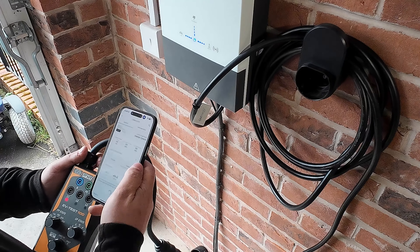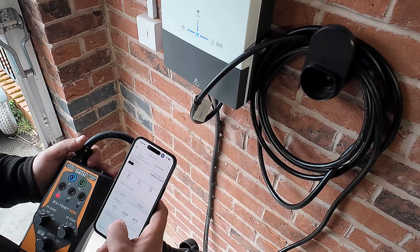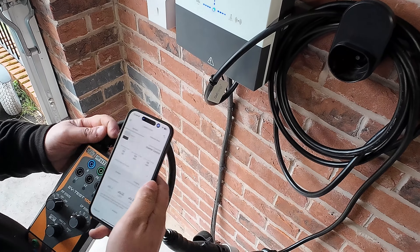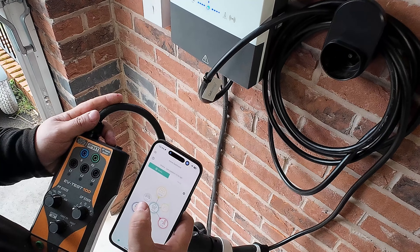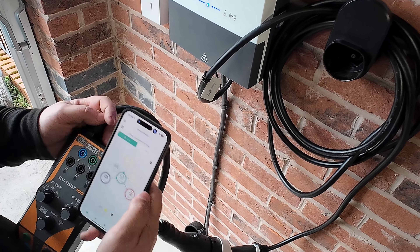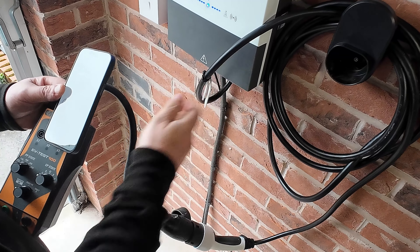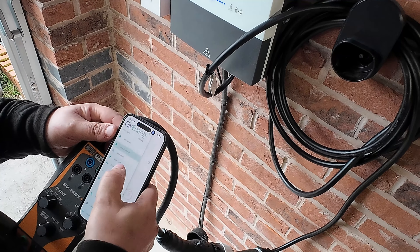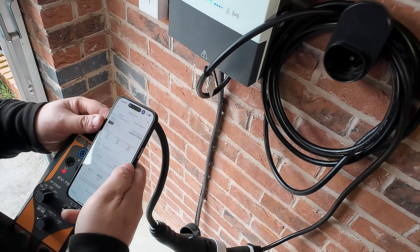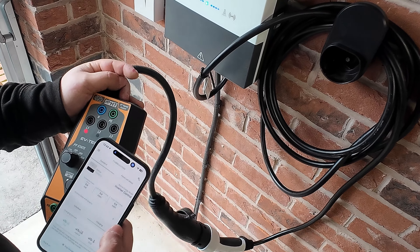This is the Give Energy charger on the wall. There's a screw going in the top, fixed with a big washer, and a couple of fixings through the back as well just to hold it secure to the wall. The wiring terminals are on this side — they've flagged them with tape because the heat shrink is at the unit and not in the van. We've got our six mil steel wire armour coming across on about a six metre run.